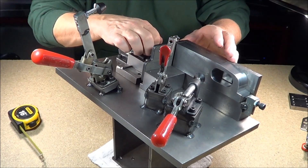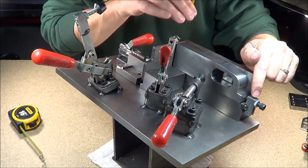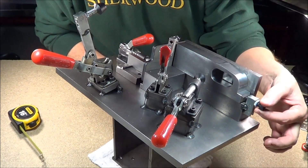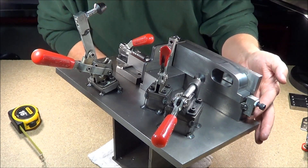That goes into this vicinity right here. We lightly close our clamp here, and then we push this one all the way up to the top. This is where I use some of my threaded bolt retainers as end adjustments. I can adjust this end and lock it down so that this can go up a few more thousandths or down — whatever. It's very adjustable. I also use them in that manner.